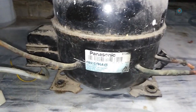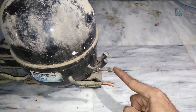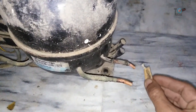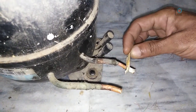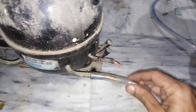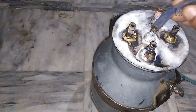Then you need an air compressor from a refrigerator — you can also buy a second-hand one from the market. There are two pipes attached with the compressor: one is the inlet and one is the outlet. When you turn on the air compressor you will easily identify which pipe is sucking air and which pipe is blowing air. Once you have identified the inlet and outlet, connect the plastic pipe at the inlet from where the compressor is sucking air, and then connect the other end of this plastic pipe to the middle nozzle of the container.